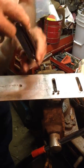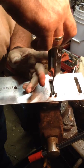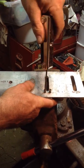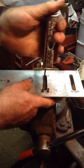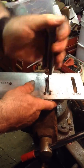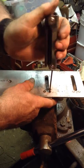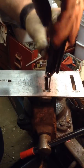To anchor these adjusters, we had to put a cleat on the bottom of this angle to catch the adjuster bolt. I had to mill the cleat on my drill press and get a flat spot so that it could be drilled and threaded.